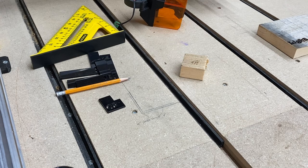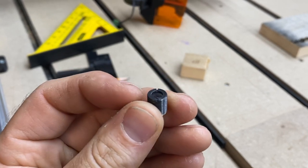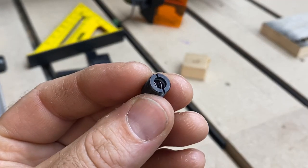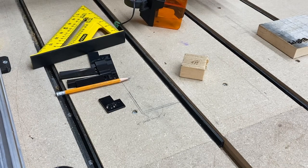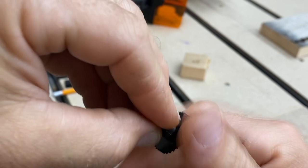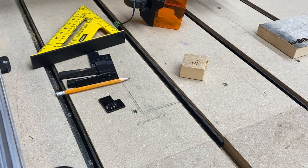For the three-element lens — the 3E — it's a little more confusing. There's a notch on one side and notches on the other side. These notches are basically touching the lens inside, very close to the bottom, while the other side has quite a bit of space between it and the lens below. So for the 3E, same idea — but we're going to have the side that's closer to the lens, with the notches, down into our focus ring. Thread it into your laser. We want to make sure you're putting it in the right way; if you don't, it won't focus and your laser certainly won't work the way it's supposed to.